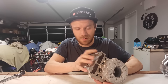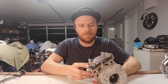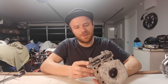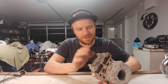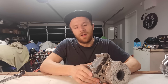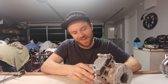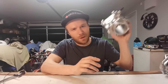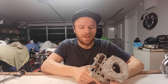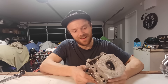The last one I mainly messed around with the cam chain gallery. On the second CAD version I thickened up all the walls so we weren't going to get any thin spots. And as a bit of a joke I put 'legal CC' instead of the 157 CC that used to be on it, because that's technically within the class regulations which I'm building the race bike for. Just my luck - I didn't think this was going to be a success so I thought I'd just put 157 on it when I remade it. Now it's actually going to be on the engine and I'm going to have to live with that.